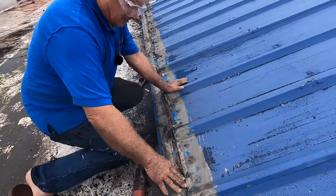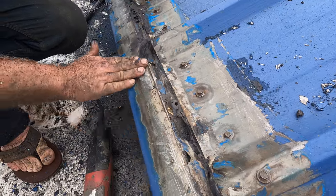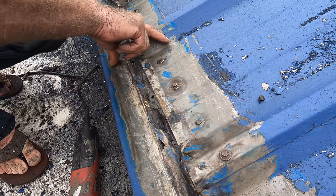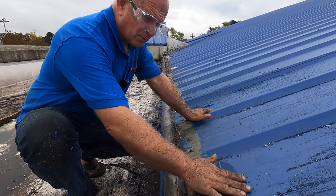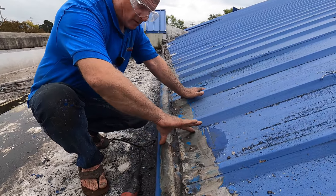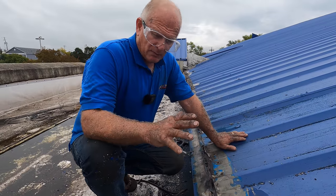Here's my idea: this surface is clean and this surface is clean. I'm going to put my transition right over this completely, but I'm doing it to fresh metal — not to paint, blue paint, caulking, and tar. You have to clean this very well. That is the first step: preparation.